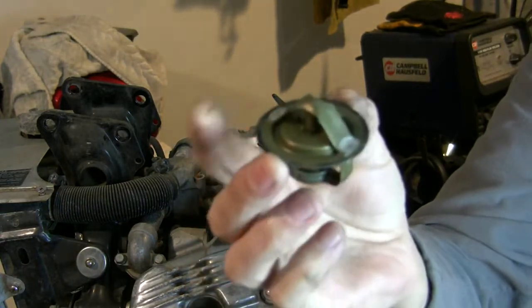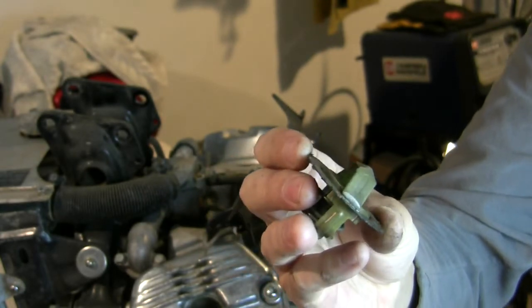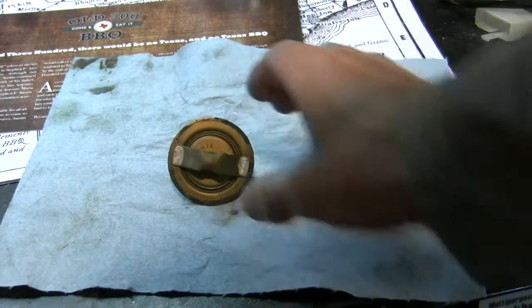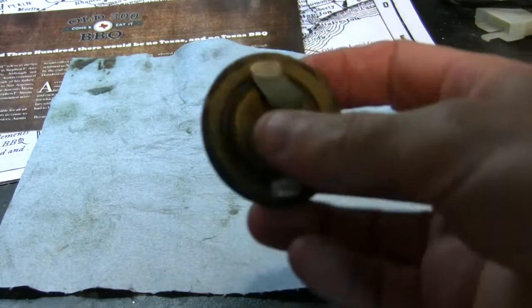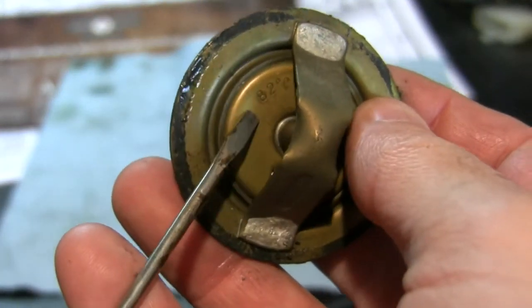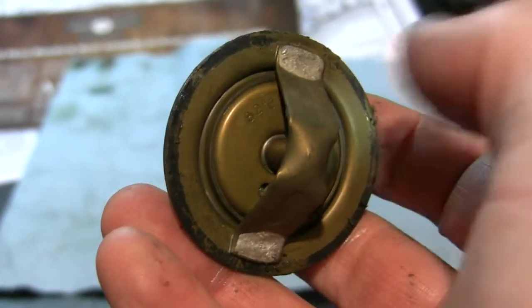It's really very much like an automotive thermostat — it even looks the exact same size. So let's figure out what temperature this should be opening up at. There's our thermostat, and cold, it's closed. If I look right here I can see 82 degrees Celsius, which is about 179-point-something degrees Fahrenheit — call it 180. So this thermostat will open up at 180 degrees. Let's see if it does.